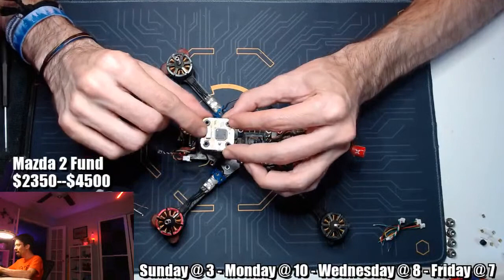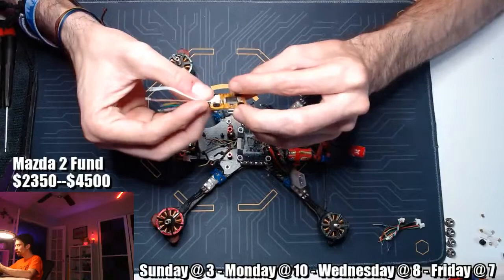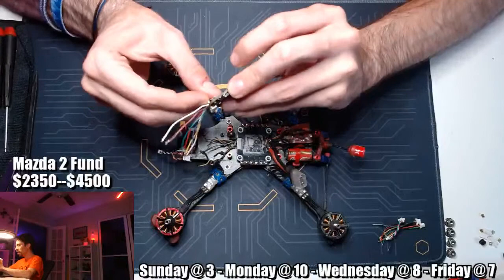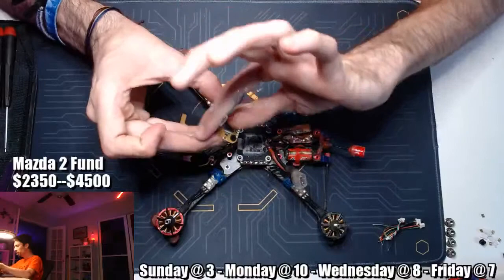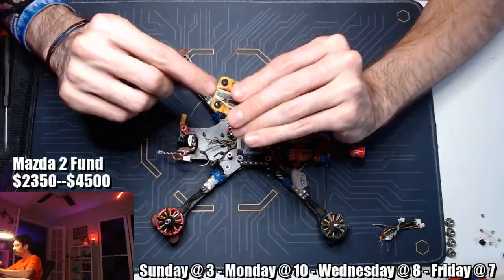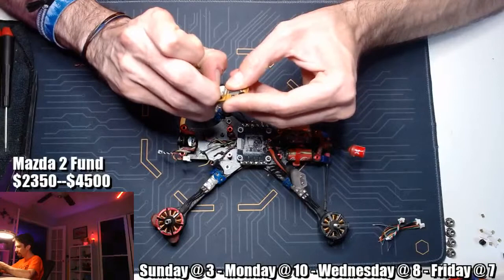But we do have this one big plug header here, but it's recessed back, which is kind of nice. So this guy's going to be plugged in here, but what you've got to be careful of is that your camera is going to have up tilt on the front of the glide frame. So if there's a big connector all the way forward, it's kind of a pain. I will not have that problem because this has been recessed back. Once this is plugged in, I do have access to these pads. I need to use one of these pads for the camera video in, but that might be the only pad up here that I need to use.